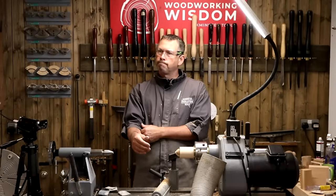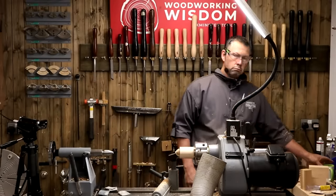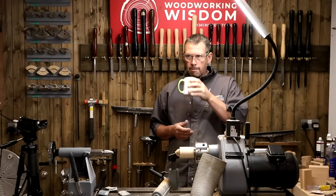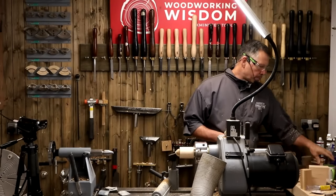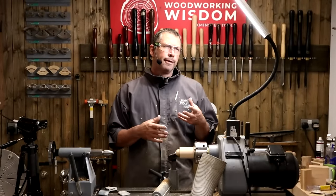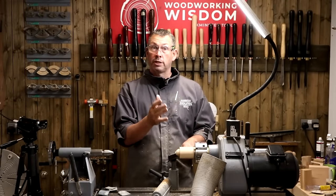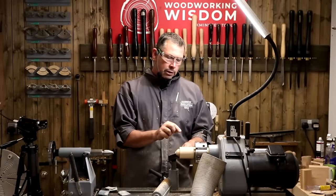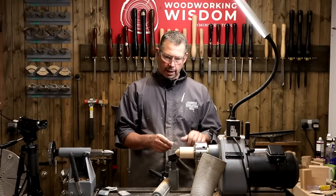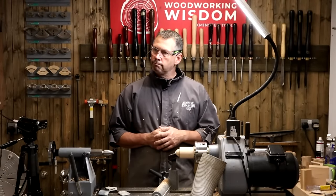It's quite interesting. And Emma's asking what the material is that you're using there. That's spalted beech, isn't it? Yeah, the main timber is spalted beech. For the jam chuck, we're using some lime, and jam chucks like to be soft without too much regular grain. A piece of ash doesn't work because it splits too easily. Same with chestnut. But beech, lime, sycamore, maple work quite well as jam chucks. They don't split readily. I'm putting a little bit of outward pressure on that, so we don't want it to be too weak.